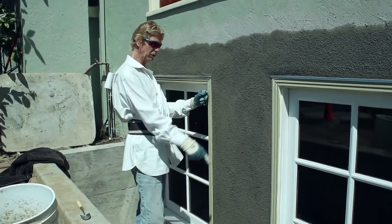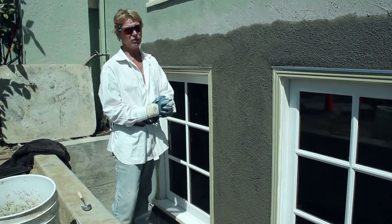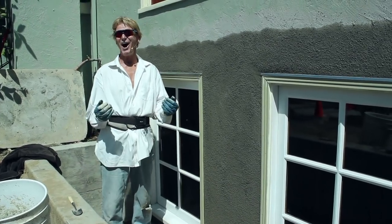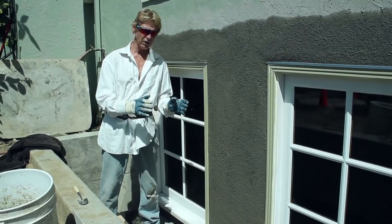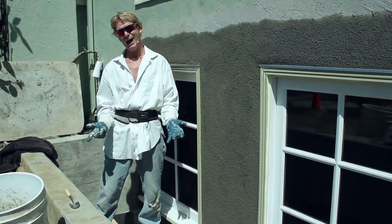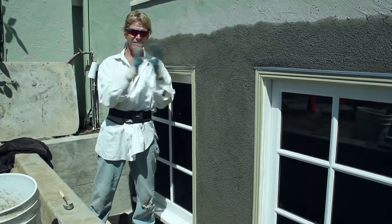It's an hour later. We've got one inch here, two inches on the bottom. When you're going over concrete, put a half inch at a time. If you've got to go six inches, just go a half inch each time. Allow each coat to suck up and absorb in, then put your next coat. Another question we get often is about working in the heat — it's about 103 degrees right now. These walls absorb the heat. If you don't keep them moist ahead of yourself — say you wet the whole job down at 8 AM, by 10 AM in a hundred-degree weather, it's just baking that wall. You've got to wet it again. That's what this video is about: how to apply cement stucco or plaster over concrete and have it adhere permanently. The right way is the mechanical bond — the wall is porous and wet, the new stucco is wet, and they absorb together. That's how they adhere.